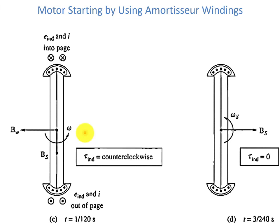That unidirectional torque, with each revolution of the stator magnetic field, will try to rotate the rotor of the synchronous motor. However, the rotor will continue to rotate in the direction of the stator magnetic field but will never quite catch up to BS. So it will not rotate at synchronous speed with just the amortisseur windings alone.